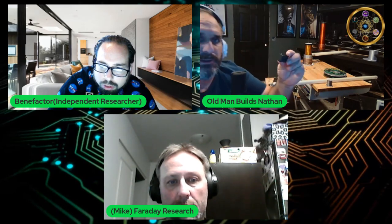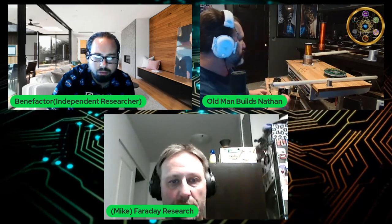Would something like one of these little guys work? Yeah, they would work just as long as they're a low microfarad. I have 0.5 microfarad. Yep, two of them. Hook that up to a full wave bridge and then hook it up to a small coil that would go on the, well, normally it'd be the secondary. So just put it side by side to your transmitting coil.